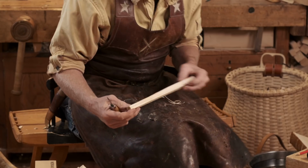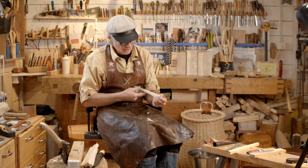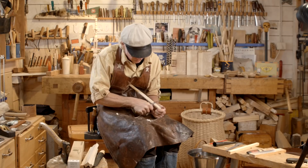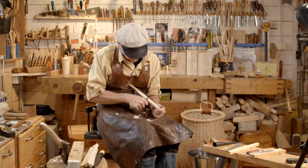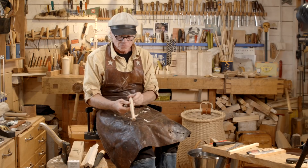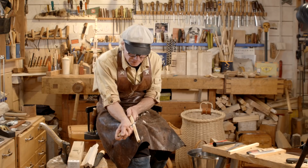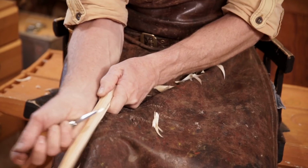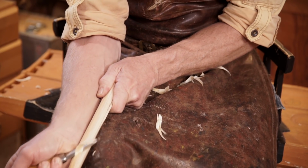So what I'm trying to do now is to find a side view here which follows that line. So I'm cutting this one down like this, all the way down to the line there. I'm using pull grip here, and I can also use a skew grip like this. So I'm cutting, because this is a little easier, because then I can see this line very carefully and have support with my hand on the side of the material like this.